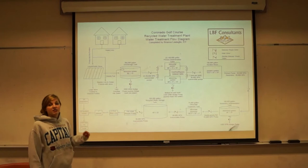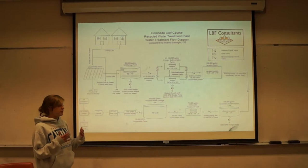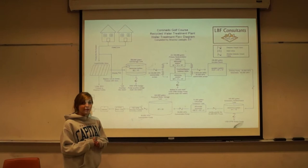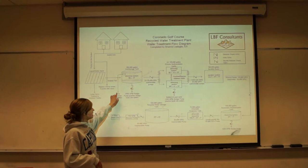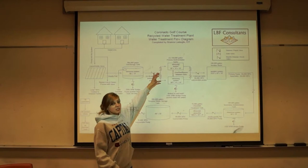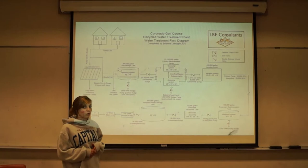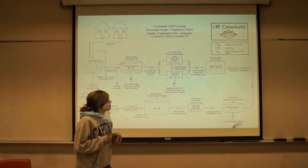Our wastewater treatment begins with a liquids and solids screen — essentially a screen that takes out the large particles and lets them be disposed of in a different way. Then we go into our grit and storage tank. This is to hold our wastewater during peak hours if it cannot go through the system yet. We figure during that process some natural sedimentation will occur, so we do have a sludge pump at the bottom. There is also an overflow on this tank. From there, we have two pumps that pump into two separate primary sedimentation tanks that are each 100,000 gallons. These systems have sludge pumps at the bottom. The system is designed so that all the heavy solids will naturally settle out due to gravity, and everything light like oil and fats will be sitting on the top and skimmed off with fiberglass flights.